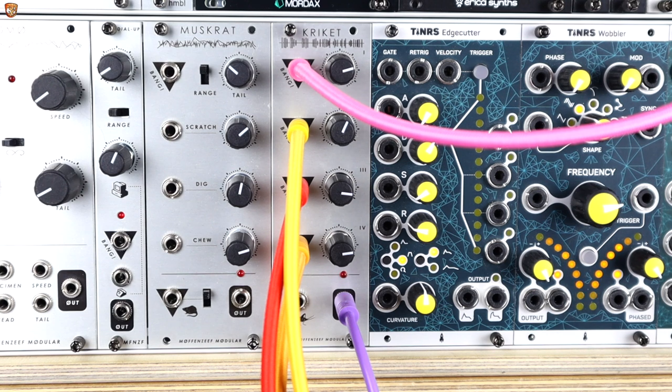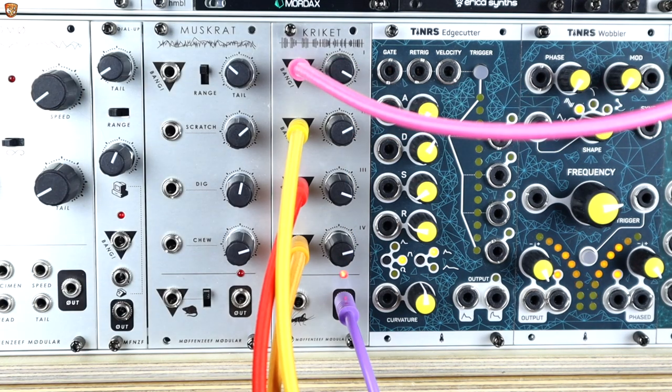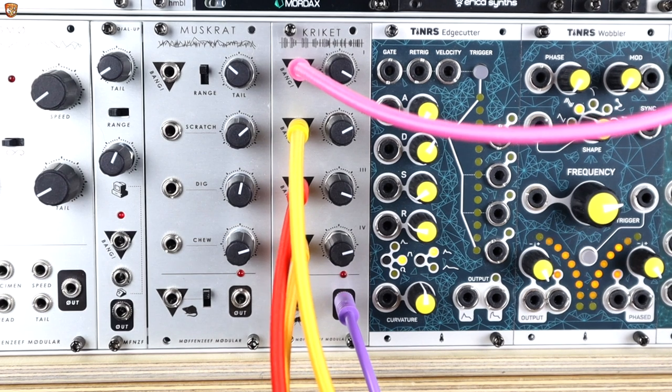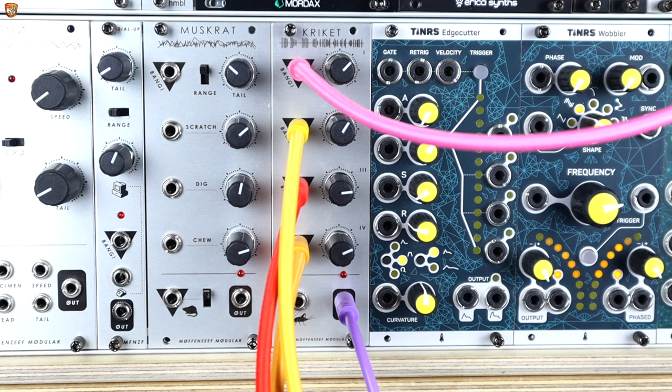Let's tune in some weird dissonant cowbell-like thing. Plenty of classic electronic cowbells use ring mod or XOR logic-modulated square waves all out of tune with each other. That might be cowbell-like — let's turn the low-pass gate down and strike that as well. Although it's definitely not like a classic 808 cowbell, you can hear that those tones are in there if you want to spend the time fine-tuning your own electronic cowbell sounds.